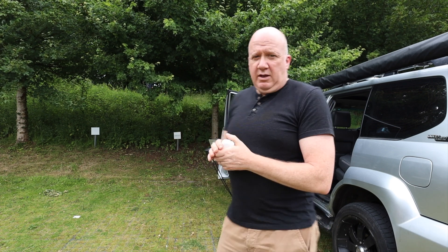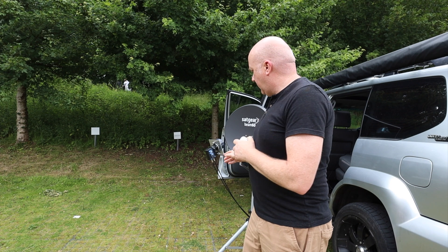What I've learned so far is that you need to get really high-quality coax and connectors — that's the first thing. The QO-100 ground station takes a lot of the hassle out of having to build up your own system with a transverter, amplifiers, and power supply — it comes handily in one box. What I have learned about the ground station though is that it does not give you true duplex operation.